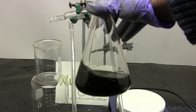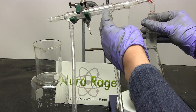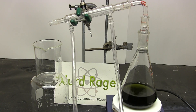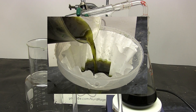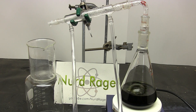Here is the copper chloride etchant solution already transferred to this flask. First we need to recover the hydrochloric acid, so we're going to set up our distillation apparatus. Once that's ready, turn on the stirring, the water supply, and finally the heating. Now before you start, it's a good idea to filter the etchant to remove any insoluble particles. Also, if you have a very high acid concentration greater than 20% by mass, you'll need to dilute the etchant so that it's lower than 20% before you distill.